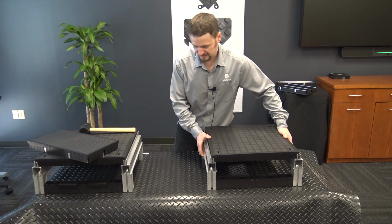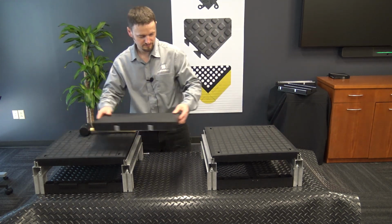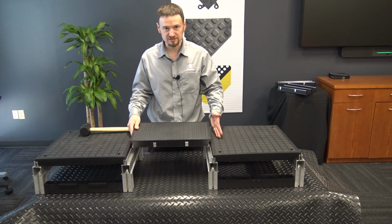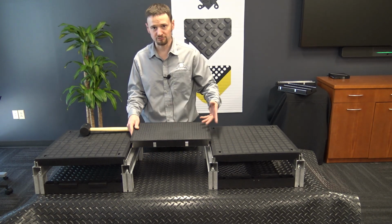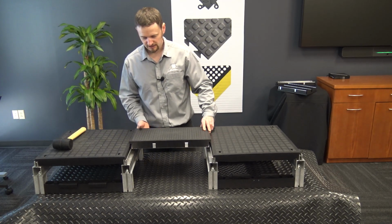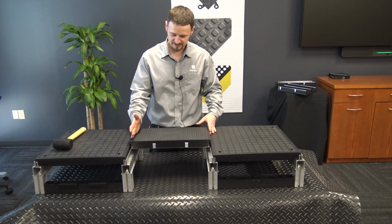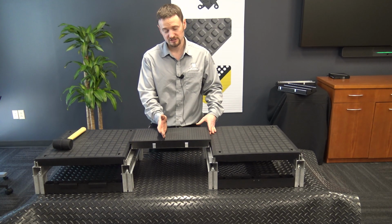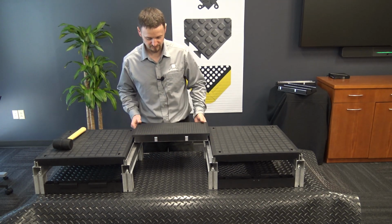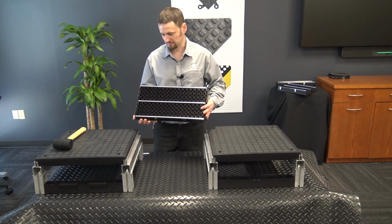And so in the current configuration, the tile would go like this. So it's 18 inches and it would go in here, but there's really no reason to do that because you could just put a regular tile here. So to customize, you would need to cut it, all right? And if you cut between 18 and 9 inches, the tile has to go this way. So you would have two tiles filling this gap, okay? And again, those support strips are still going between the two beams.